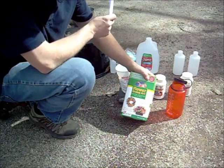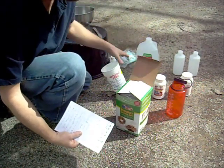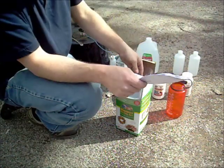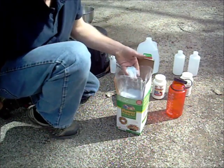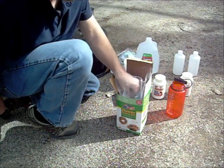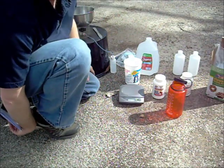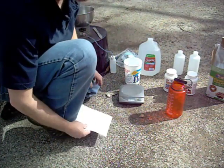I'm going to use what I hope is the same thing: a flower-drying silica gel from the craft store — it says silica gel right on it. The odd thing is there's this little blue particle in here, which I think is an activating agent. When it gets moisture it turns pink, and you can reactivate it by microwaving it and removing all the water, and it turns blue again. I'm not sure if that blue-and-pink activating stuff in there is actually pure silica gel, so that may cause a problem — but that's what we're using. I got a big bag of it from the craft store; it's for dehydrating flowers.